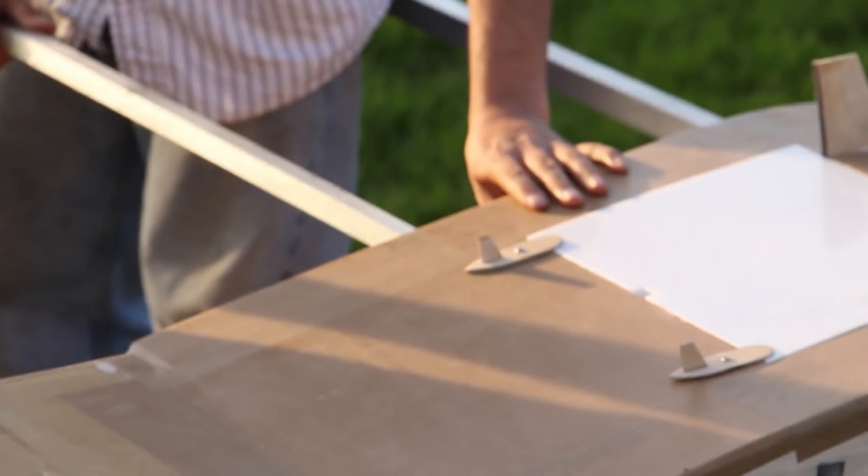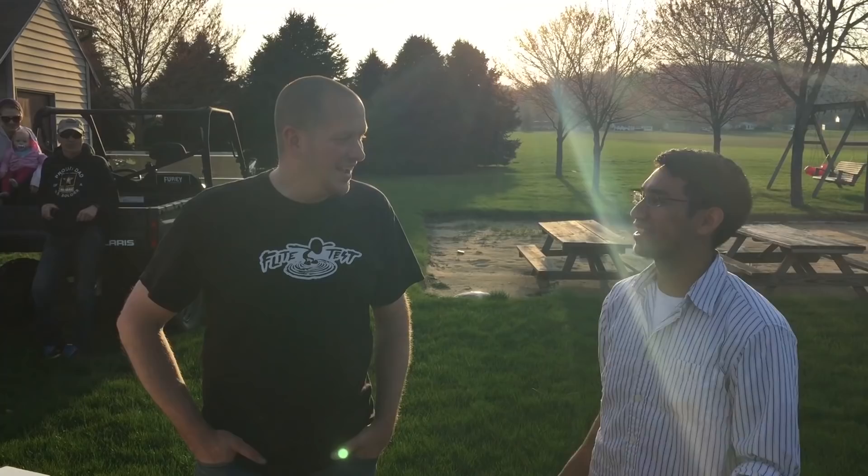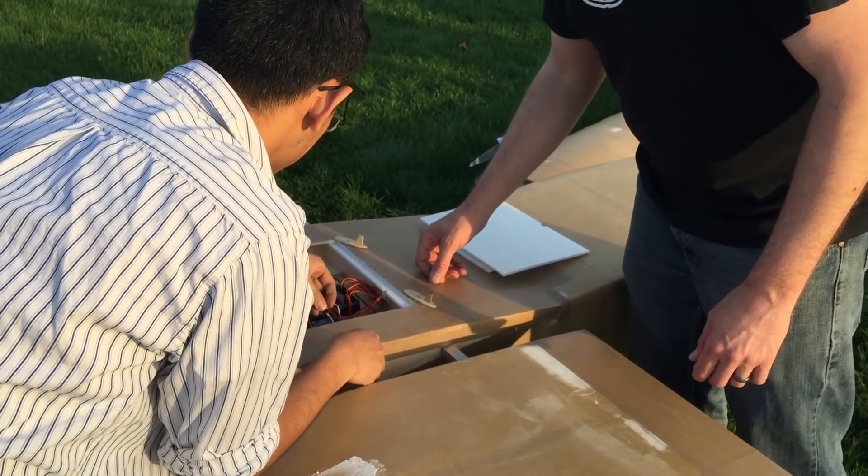The spars are from Home Depot and Lowe's — and that was kind of a fail. If I can recommend anything when building planes like this, try to buy actual aircraft parts, because this is not aircraft-grade anything — not 6061-T6 aluminum tubes. I would have bought the right stuff but I was on such a time crunch and didn't know where to source proper airplane parts. I just winged it.